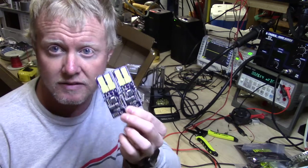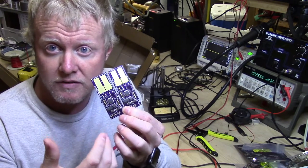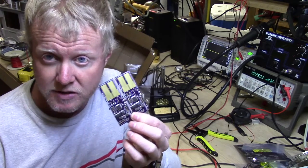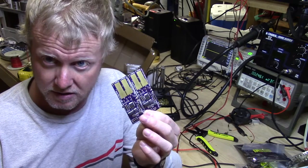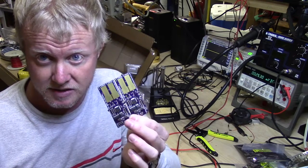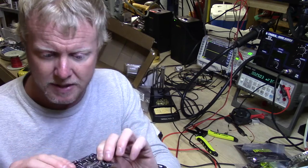we basically have, hopefully, two programmable chips with the 485 driver enabled, so I'll be able to set one of these up as a master and one as a slave. And we can start developing a protocol that will cause these to do things if they're not in standalone mode.